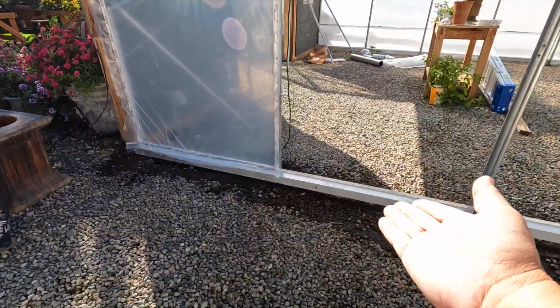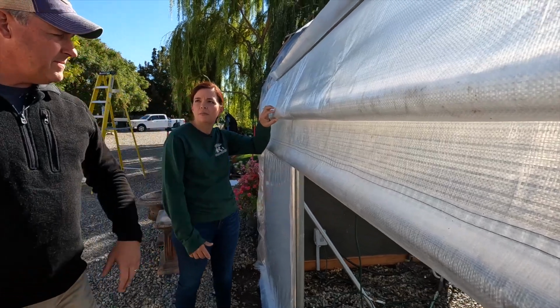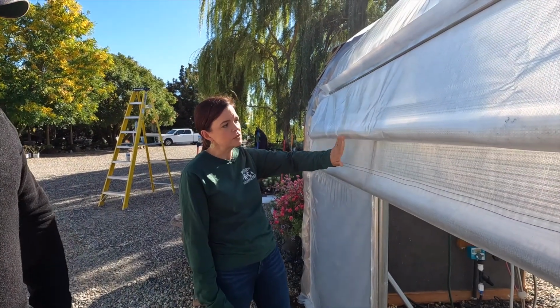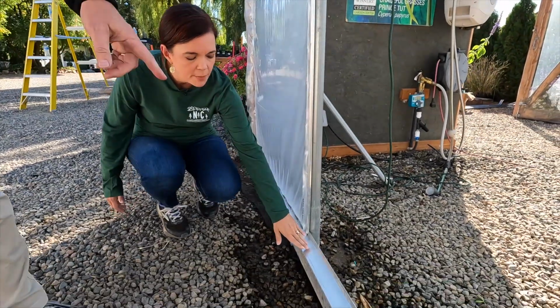All right guys, walk us through. I'm going to let Jerry go because he's the master greenhouse builder, the expert. First off, when I was explaining what we were doing, I said these metal things, the hat base. We had to install a new hat base because they now have a raisable curtain on the side to allow natural airflow without fans and shutters and all that good stuff. This is the curtain, a heavy cloth fabric almost. It will roll down and rest on top of the hat base.